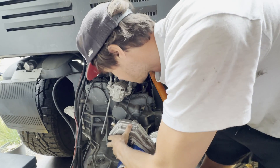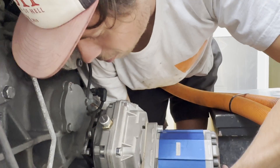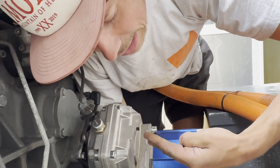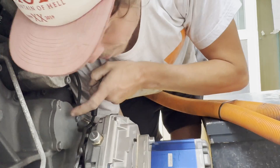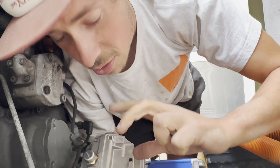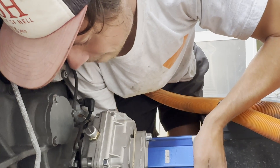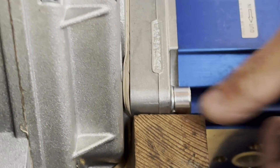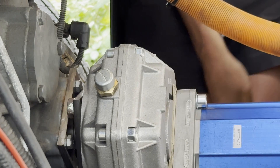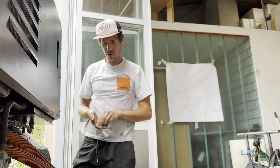These plates are mainly to hold the pump attached to the PTO. There's a lot that can go wrong here, because if the pump is hanging slightly and the axis of the PTO and the gearbox aren't aligned, there will always be pressure on the bearing while turning, and that would wear it out. I have to find a way to adjust for that. It feels pretty good — I'm going to risk it and make a little spot weld just to keep it in place.